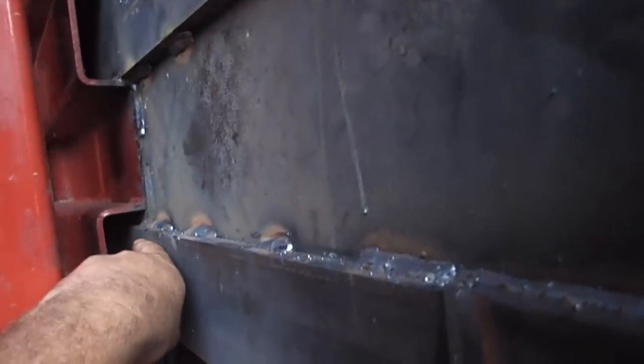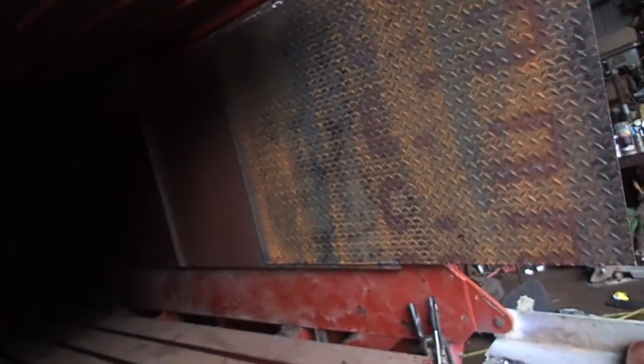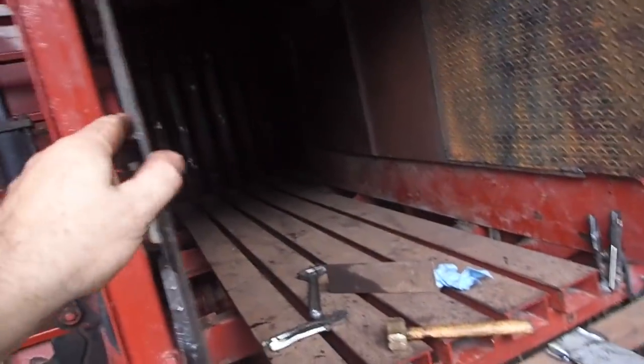I shot it back into the original boards, 14 inches. Then I bought 3/16 inch plate steel and put it underneath there to take up the gap of the board and laminated it. I added 20 inches so that I would get all the way to the end here, and again 20 all the way across, and then I put 2 foot of diamond plate in and 2 foot of diamond plate out. And this is 3/16 also. So I've got a lot of support there.